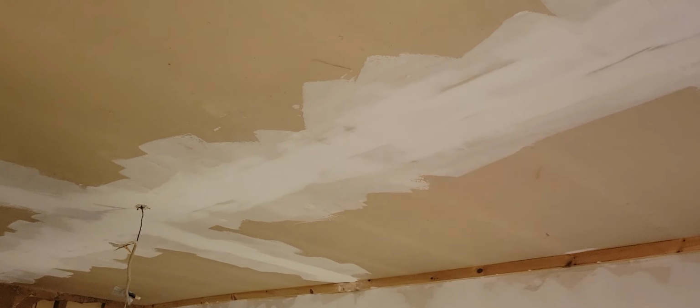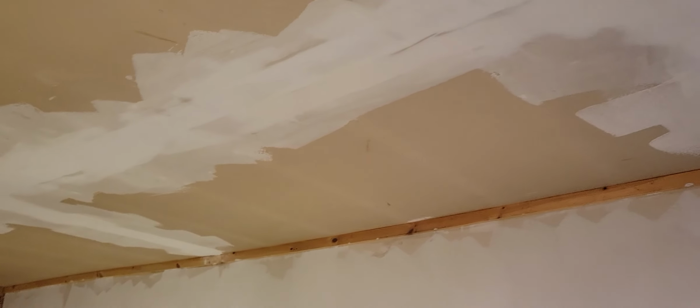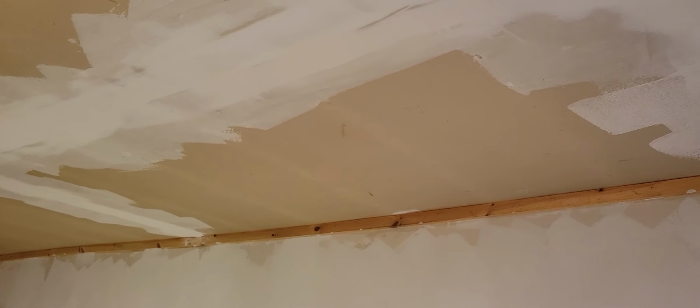Now this side had some plaster and some beaver board, but it also had some sheetrock, and also on the ceiling. The sheetrock on the ceiling seems to be fastened to plywood behind it. This is a mystery, but the seams were poorly done, so we put up the mesh tape and redid them. I think it turned out pretty well up there. You can see two different colors now. They had a wood stove for years, and I think that discolored the old sheetrock, but ultimately we're going to paint this in a nice pleasant ivory white and the whole thing will be brighter.